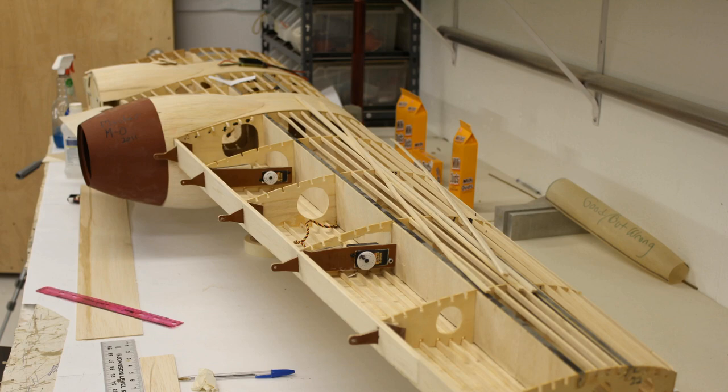One of the things about the B-36, it being so large, is it ended up having over 40 some servos throughout the entire airplane. And to get the ailerons to actuate right and to get everything to work properly, I knew that just about every flying surface would take a minimum of 2 servos. So there were 6 flaps. That right there is 12 servos, and then you've got the 2 ailerons, that's another 4. So pretty quickly the servos were really being eaten up on just the wing.